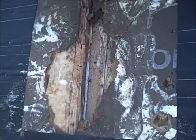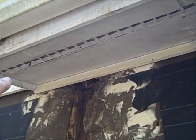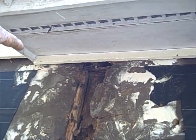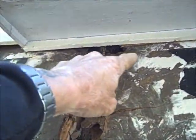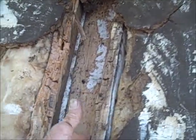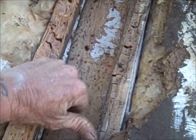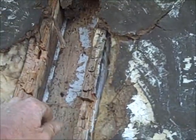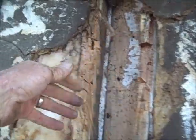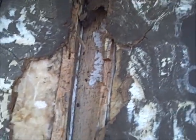So what actually has to be done, instead of just a few pieces of siding being fixed — because it's been leaking behind there for so long — the boxing is going to have to come out, that top piece of trim board is going to have to come out. I'm going to have to get up behind that boxing because we've got a top plate that's completely rotted through. There was a T right here on the inside. Both 2x4s on the T are completely deteriorated. I can't even nail siding back to that, so I'm going to have to take this siding down off of this wall.